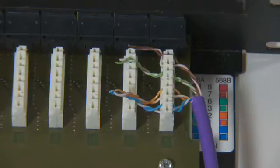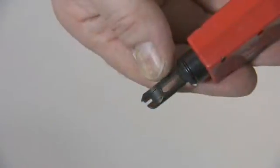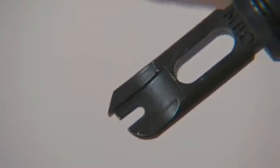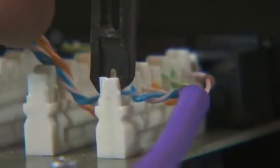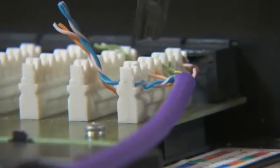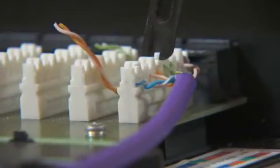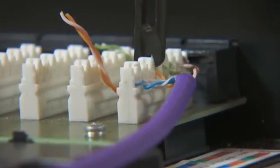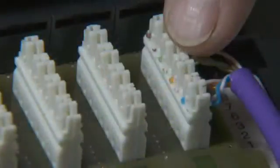This is now ready for cutting. Ensure that the cutting edge is selected to the outer edge of the IDC to cut the waste cable and not the incoming cable. Punch down the individual wires with the correct terminating blade in the impact insertion tool. Repeat this procedure for each cable to be terminated, ensuring that all wire offcuts are removed from the patch panel.